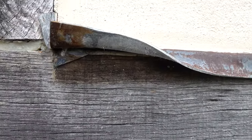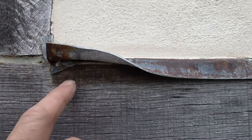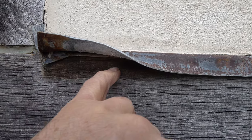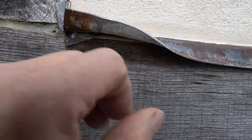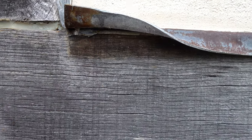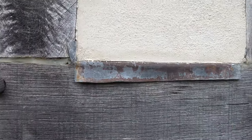The other thing I don't like is this — somebody's put lead on the base, on the bottom of all of these. Why have they put lead on the bottom? Because lead traps moisture under the lead, so you get soft timber underneath. And you can also see there are bits of blue plastic and anything and everything in here that's wrong.